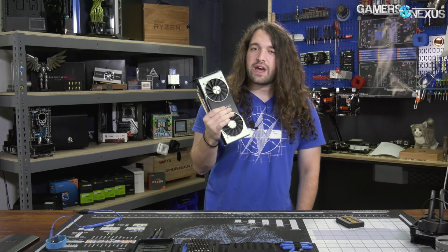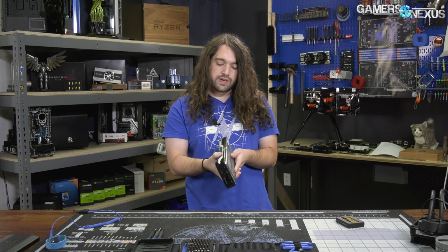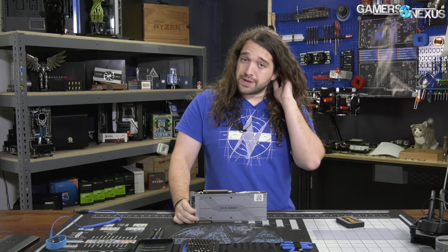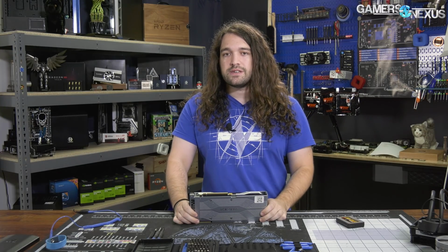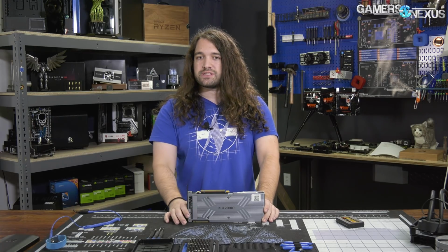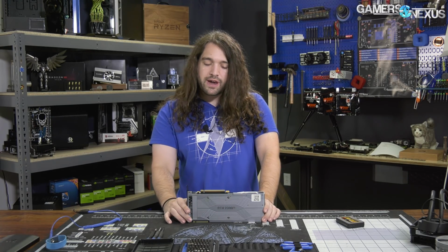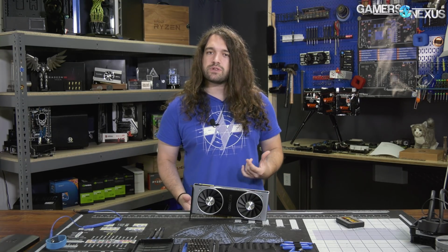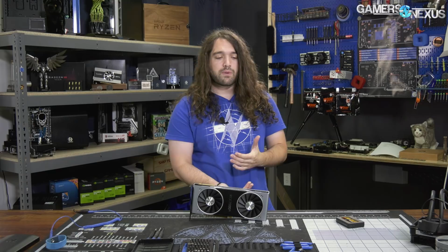So quick note on how these things work then. They are thermally constrained and also constrained by current and power limitations. The biggest constraint we have faced is unfortunately power, and liquid cooling can't fix that. But it can stabilize the frequency, and we might be able to get it a bit higher because the frequency-temperature curve that NVIDIA has for the 20 series is really similar to Boost 3.0, where just by dropping temperature a couple degrees, ambient temperature that is, and feeding the card cooler air, putting more fans on it, we were able to get the score in Time Spy Extreme a bit higher.